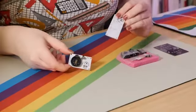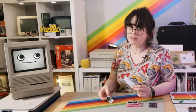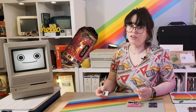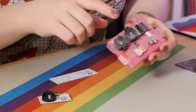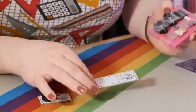Well, Ron sent us a remote battery and a remote battery 2 board. Oh yeah, hi Ron! Essentially what this does is allows us to replace a Macintosh clock battery, which are known to leak over time, with a more durable and long-lasting CR2032 coin cell battery. And it comes as a kit, so all we need to do is solder on these coin cell battery holders to the board and a couple other components, and we'll be good to go.